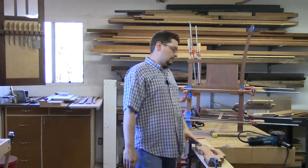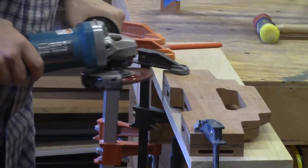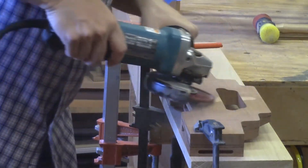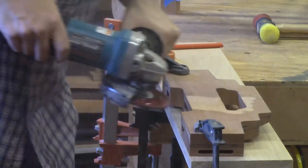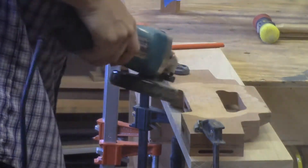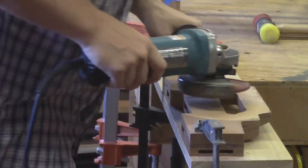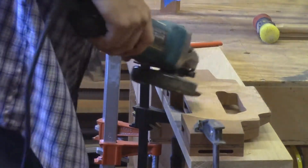I finished smoothing the front face at the bench, flipped it over, and have the rear facing me now, clamped down on both sides. What I'm going to do is start with the center, and once I finish the center — at least the initial carving — I'll then work on each side and smooth down to the sides. Time to carve the indent in the back. What I like to do is carve from the top down, creating an indentation towards the center, starting before the mortise area, working one side then the other. I continuously get deeper and deeper, carving this indentation — the back curve from the top towards the bottom — working back to my lines but making sure not to go below them.